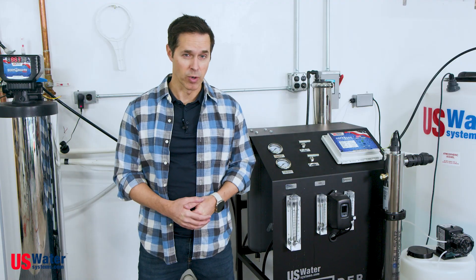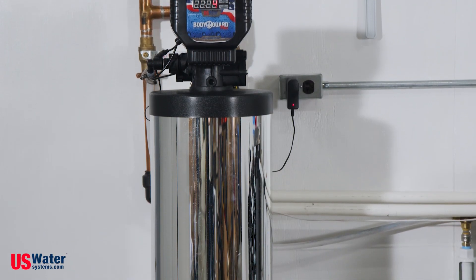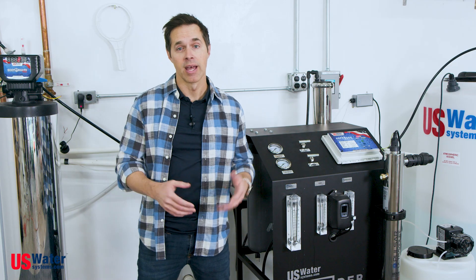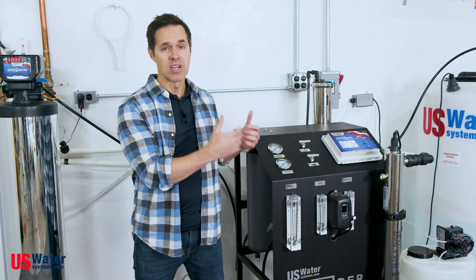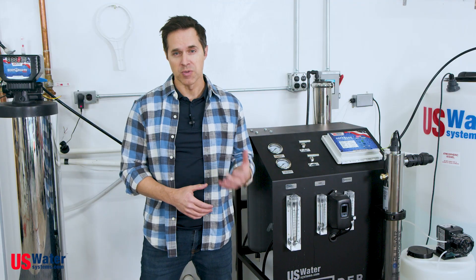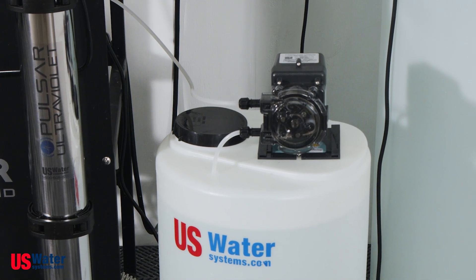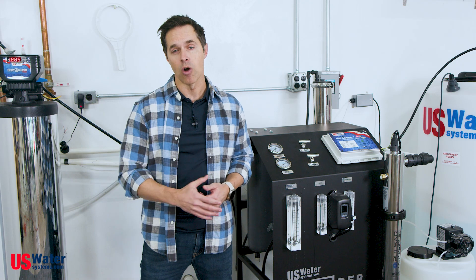So now we've covered components and system requirements. Now let's look at the path that water travels through the RO system. In this configuration, water first travels down through the Bodyguard filter, making contact with the carbon media, and then over into the inlet of the RO system. As water flows into the RO system, it passes through a 5 micron sediment filter to capture and filter out any sediment, silt, and debris that may be in your plumbing system. After water travels through this pre-filter, it then travels by an injection point for our anti-scalant injection system. The injection pump will run and inject the anti-scalant solution anytime the RO system is running.